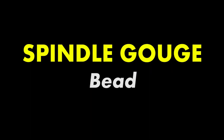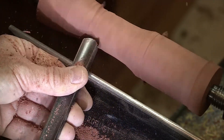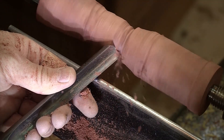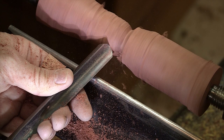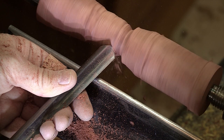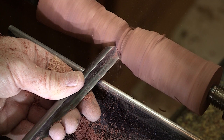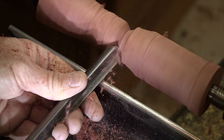So who makes beads? I do. And you always sneak up on a bead, right? Part of the reason in making a bead is you have to make sure that you roll the tool and do everything properly. So we're going to make a cut going in right here, rolling the tool as we make the bead. But if you don't roll the tool enough, you're going to start catching that leading edge. We're doing well here — you can see we're leading with the tool. Where the cut is happening, the tool is supported by the tool rest. But you continue to roll the tool and actually lift the handle to make this bead occur.